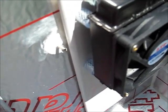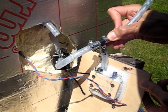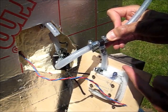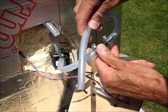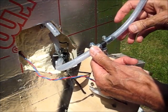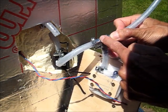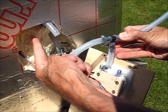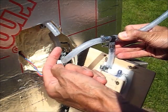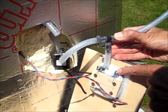This is still loose as I haven't finally fixed it — I'm still adjusting things. Before I close it up, I'm going to show you the modified cooling circuit. I've installed a new T-piece which gives me a filling tube I can fill from and then seal off. You can see the cooling block, and the circuit goes up through the T-piece, through the pump, through the wall into the internal cooling radiator, and back from the radiator onto the cooling block.